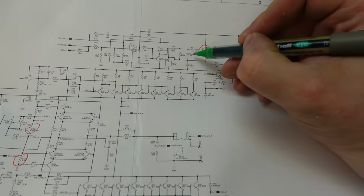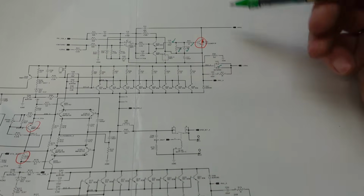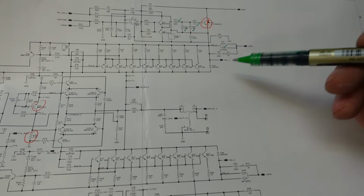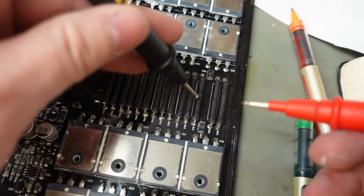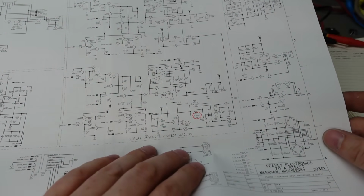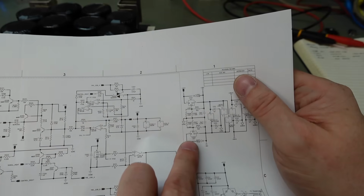So just start marking some of these parts on the schematic we tested as good, so that diode was good. All this round here is fine, which makes me think that whatever caused it might just be overload, and it may just be something connected to the speakers maybe that shouldn't be. What about this diode here? Yeah, if that's gone, that would have taken that out. D197. That's just down here. 0.4 volt drop. Yeah, it's alright. I should check out where the minus 18 volt supply comes from, because it may have been damaged. The minus 18 volt rail comes from IC303.